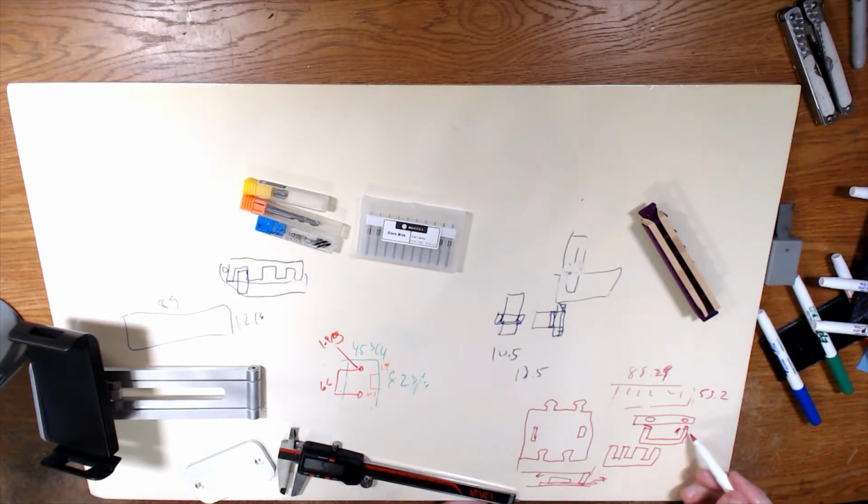But these little holders that we're making still have a bottom, okay? And we can just make sure that the bottom is in this direction. That way, when this gets pulled out, the bits don't slide out. Going the opposite direction, when we're pushing it in, if they slide a little bit, that's not going to be that big of a deal because we're just going to pull it back out. Whereas if we're pulling it out and it's sliding out the other direction, then the bits at the far back can fall off the back end, and then we are going to have a little bit of annoyance reaching under there and getting them picked back up. So that is the deal there. Back to Fusion.